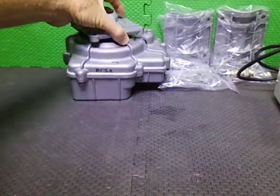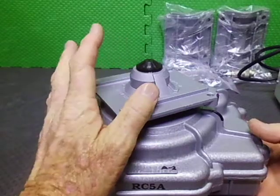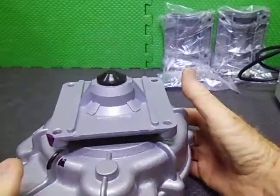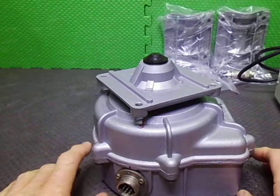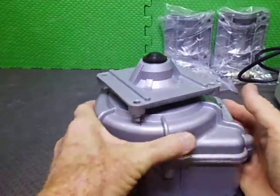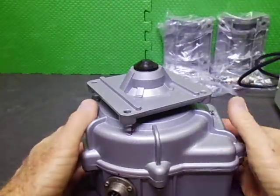The actual rotator — this rotator has a brand new motor because the motor was burnt out as well, so this may have happened at the same time. It was a nice mess, as usual. This rotator has a brand new motor, it has been completely rewired. The casings were cleaned and glass bead blasted, so was the output flange as well as the mast clamps. They were glass bead blasted and then I've etched primed them.